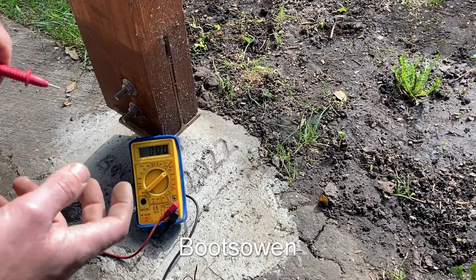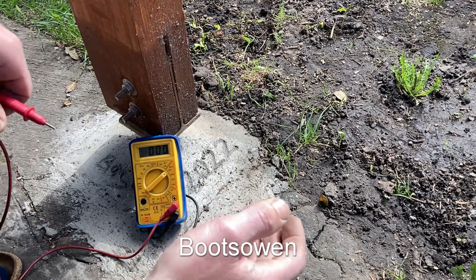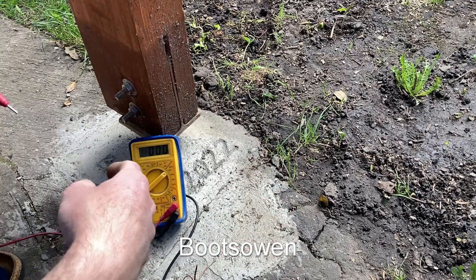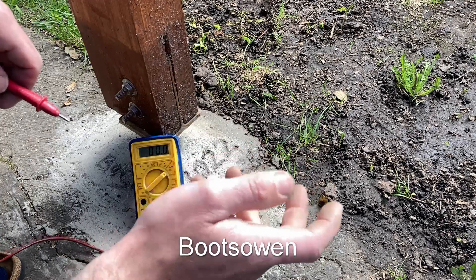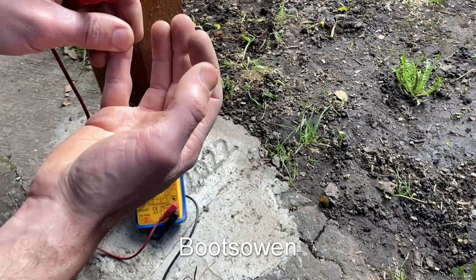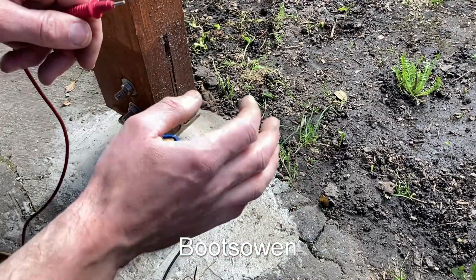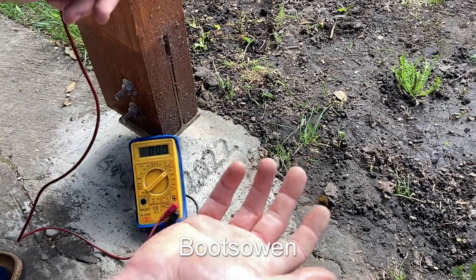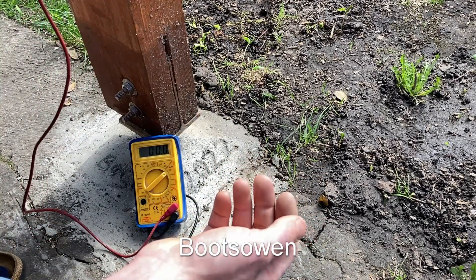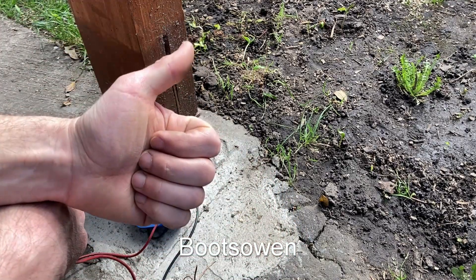On 200 milliamps — nothing. 20 — nothing. 2000 — nothing. 200 microamps — nothing. So I'm not getting any current flowing through it. I'm reluctant to touch it because I've experienced that before and it's like an electric fence, but two volts doesn't seem right. It could be that the earth has dried out, or it's a dry day and the roof isn't conducting as much because it was damp in the morning last time. If you know anything about these things, let me know in the comments — this is a solar panel earthing question. Thanks for watching, see you later.